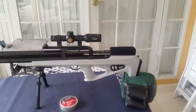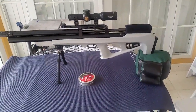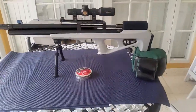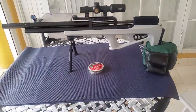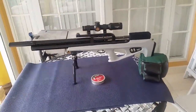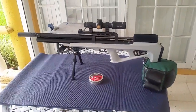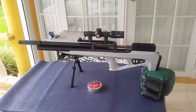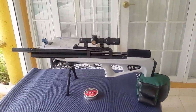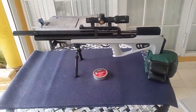And as you can see, the finish has kind of a glow rather than a shine, which is what I was looking for. I was looking for like a real matte finish. I didn't want a high gloss shine. So my paint store added quite a bit of flattening agent so that I could achieve this sheen.